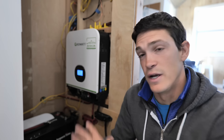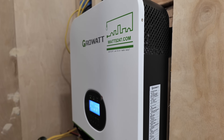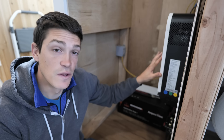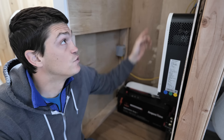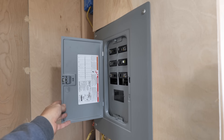I also want to review how the battery and the charge controller inverter have been working for us. Just to recap before we get started: this is a 24-volt 3,000-watt Growatt all-in-one charge controller inverter. It has a 3,000-watt inverter built in as well as an MPPT charge controller. I have that tied into our breaker box — just a standard AC breaker box.